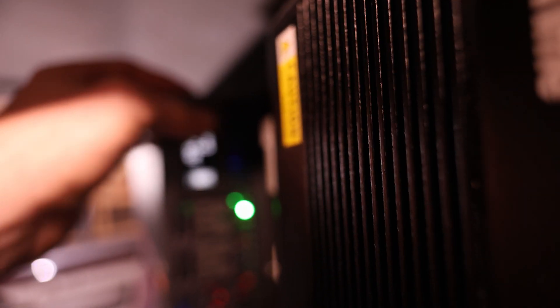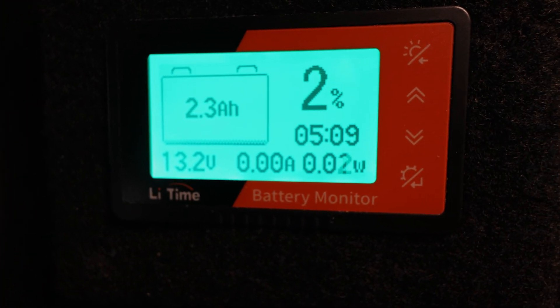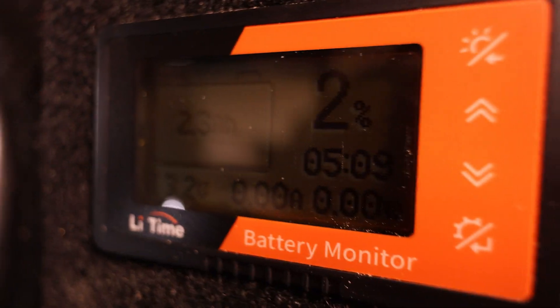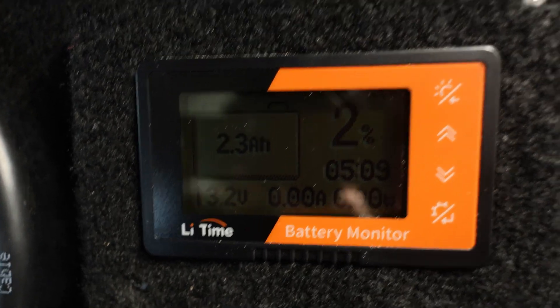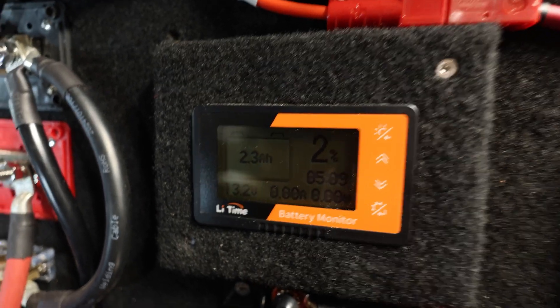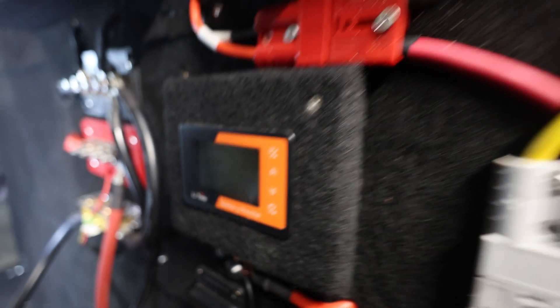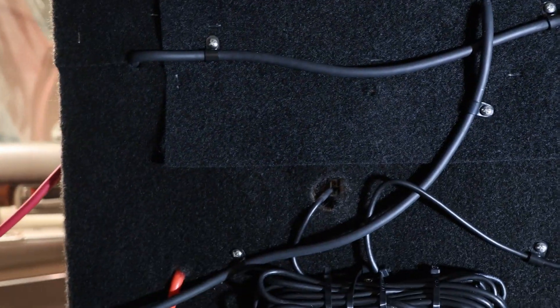Now if we turn the inverter off, it's basically just homeostasis — we can see the wattage drop, the backlight dims, and we're back to zero. This monitor doesn't take hardly any power to run. I fastened it to a piece of board and drilled out from the back to run the wire into the shunt, with a small positive wire going to the bus bar to power the battery monitor. Not super clean at the back, but I've run a bunch of wires behind here to gain a little more cleanliness on the front and used small fasteners to keep the wires tucked.